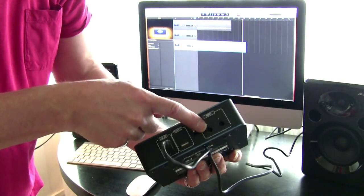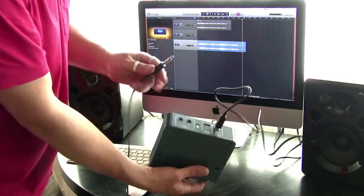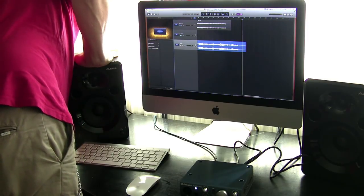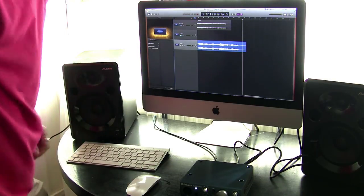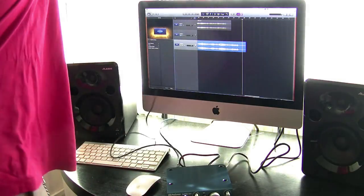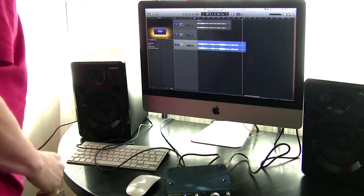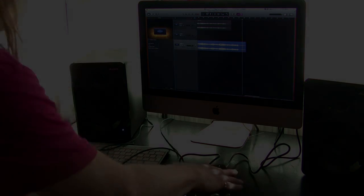Yeah, we just connect the left-right speaker outs to the speakers now. And for that you just need two quarter-inch jack-to-jack leads. So, the nice one. Lead number one. Second speaker lead. Both speakers plug in here, left and right. And then this special lead carries the signal across to the other speaker. Right, so let's switch them on. Power on the back, and we should have something now.